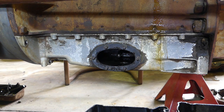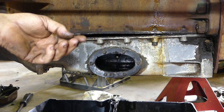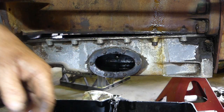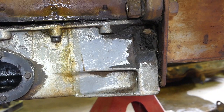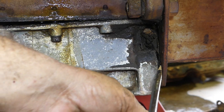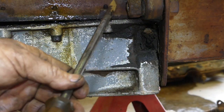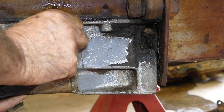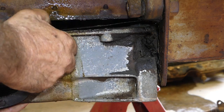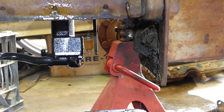I've been around the other side and unbolted everything, and the sump has been held in place with just one bolt here. If we zoom in there you can see the gap between the front plate and your front axle support. The tractor is safe - you've got two bolts here and another two bolts on the other side, so there's still four bolts holding it on. We'll pop this up, pull out this last bolt, and there's the sump down.